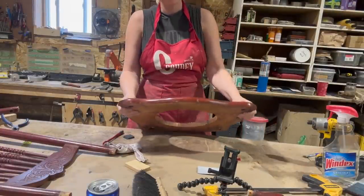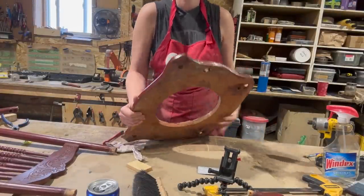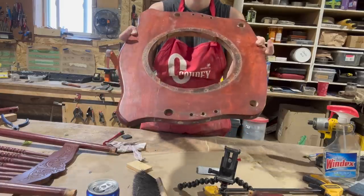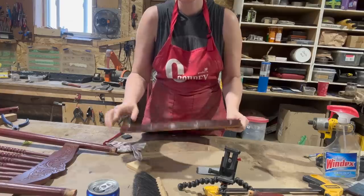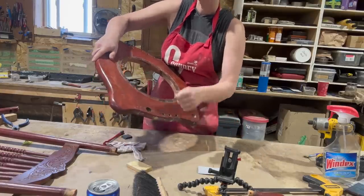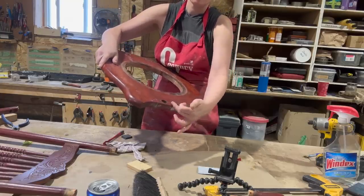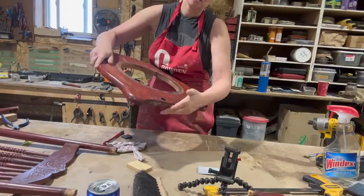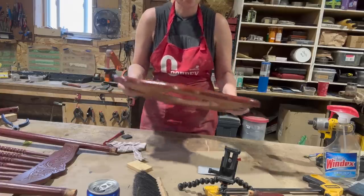Alrighty, so I've got this seat put back together. You can see I've got a fastener in there because that section that we had to re-glue was a really bad fit. We did use epoxy because of that, but also it's gonna take a lot of pressure from the arms pulling outwards on that joint, so anything outwards this way is gonna put all the pressure on this break. So we've got a dowel coming in and epoxied, and so these will also be tightly glued as well, so that'll help make that stronger.